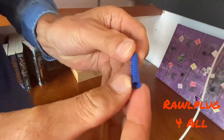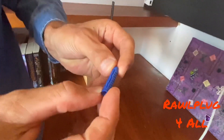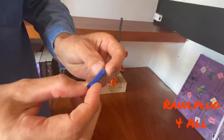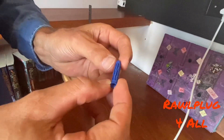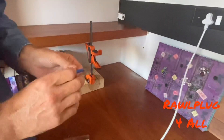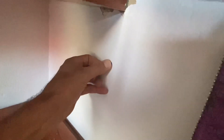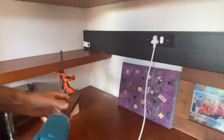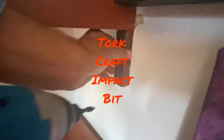The other thing I've chosen is a little for-all plug. I know this is going to work in the wall because, as the name says, it's for all — it's for concrete, for brick, you can even use it in timber cladding or drywalling. I'll just pop it in like that, get it seated nicely, and then take my little impact driver and match it up.